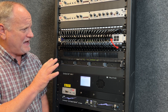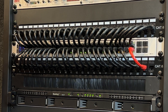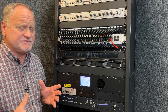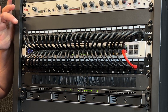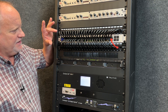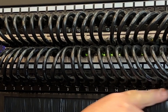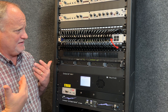For what you tuned in for on the patch panels, this is the way that I do all of our patch panels — even for other customers. This is what I will do because I just like cable management. I like things strapped down, things to look good, to look like it belongs the way it's supposed to be. I like to use the keystone. This is Cable Matters 24-port patch panel. I use two of those because on the Ubiquiti switches they're on top of each other, so you need the top and the bottom. The only thing I don't like about the Cable Matters is they number their ports, which I understand, but they never coincide with what you're doing.